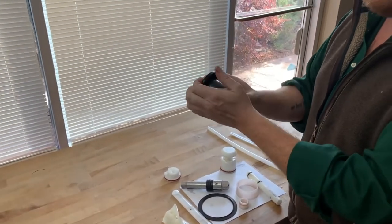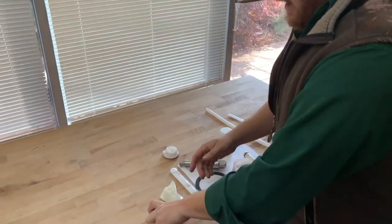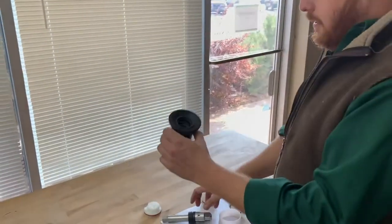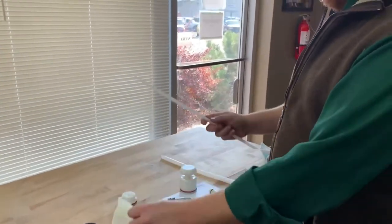So on these, you really want to be looking to make sure you're getting a tight, good suction on the rear of the barrel and that you're not having any product leak down. So your boot and rear seals and your blades are really important, okay?